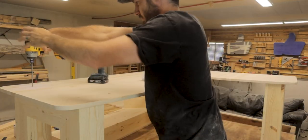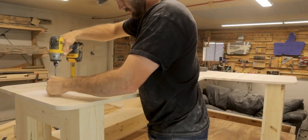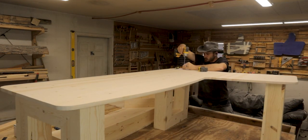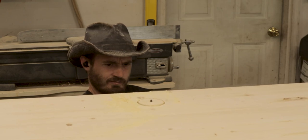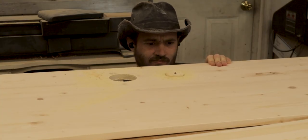The legs get attached in pretty much the same way. I used the pocket hole bit to drill straight down into the bottom panel and then put screws directly into the legs from the top. Then I could unscrew everything and drill the last few holes for all of the different inserts, and then once I was done with that I could finally put the finishes on.